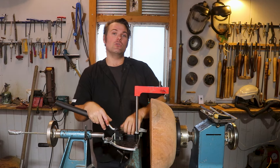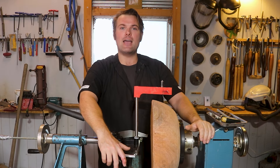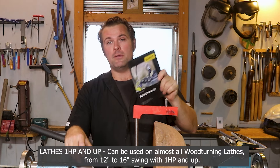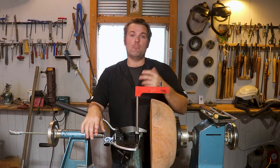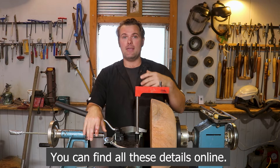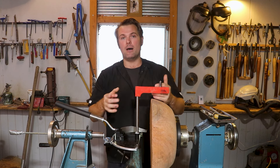The main thing you have to make sure before purchasing a bowl corer is to see that your lathe has the requirements. In their user guide, they've got a minimum requirement of 1.5 horsepower motor. The main reason I'm pointing this out is because I hear people all the time stalling their lathe, getting big catches — they just don't have that power to be able to core bowls out.